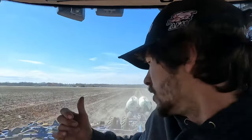The other bar, the other 60-foot bar, it's over there switching out tanks right now. But it had an O-ring that come apart in one of the towers. The towers is, I don't know if you can see them right there, I'll have to show you probably when I'm loading. But it's basically what the hoses off the tanks run into. And then you got like a bunch of different hoses coming out of that. They run it to each individual knife. But the other bar had an O-ring that was blown in the tower, and it was causing not much gas to come through the hose. So they got that fixed, and the other bar's been rolling good. So, I mean, it's going.